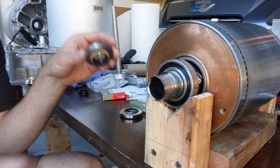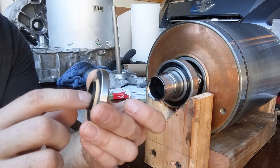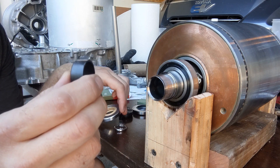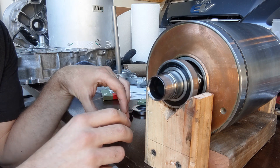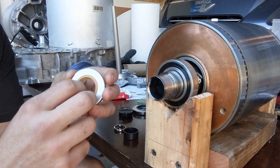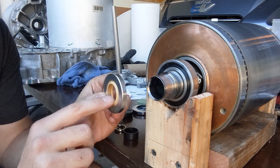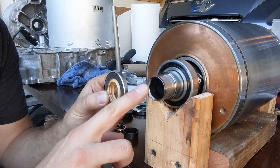I'm going to start with the Chen Ming seal and see what happens. The seals come with a protective sleeve. The problem is the protective sleeve outer diameter is 28.5mm while the shaft outer diameter is 30mm. So we have to first get a better idea of the geometry of the lips after we put the seal on the shaft.